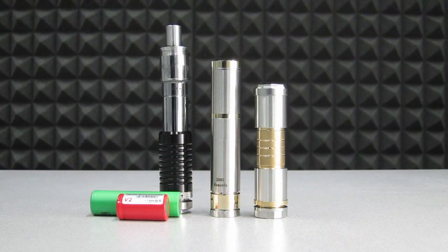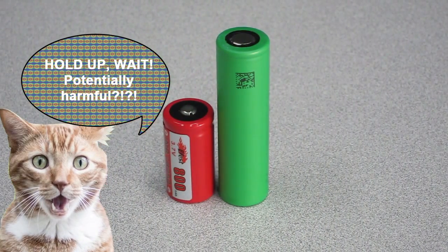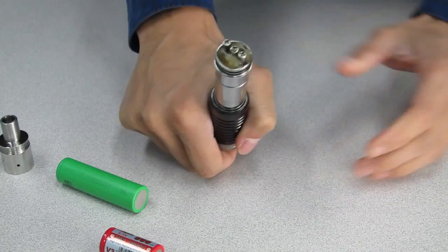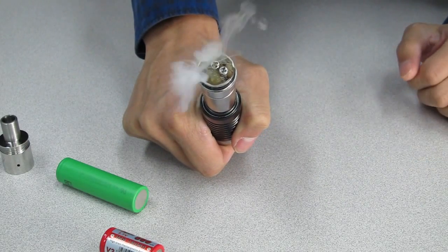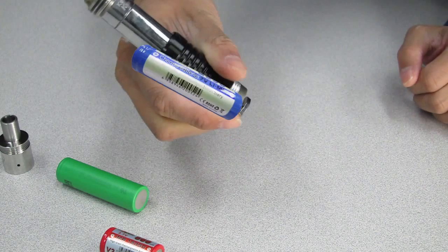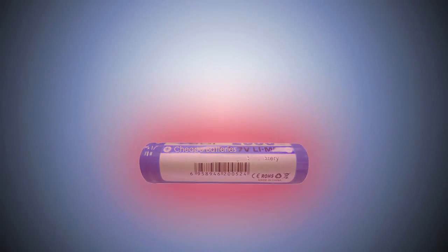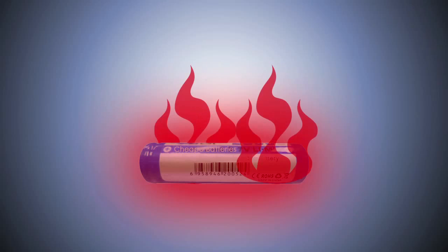Because of its very simplistic design, they're extremely durable and modifiable. However, it should be noted that they are potentially harmful. No lithium battery powered device is 100% safe because of the amount of energy stored in a small battery. The problem with mechanical mods is that they do not have a chip that can monitor things like short circuit and over discharge, which can basically make the battery unstable to a point that it may overheat and catch flames.